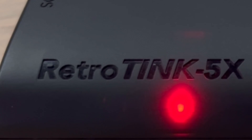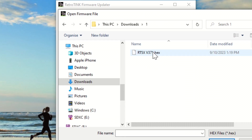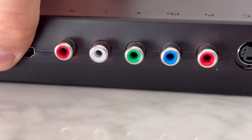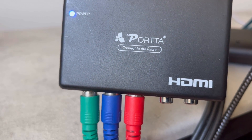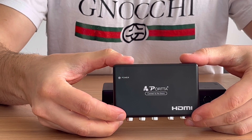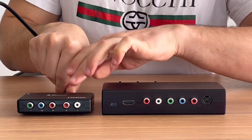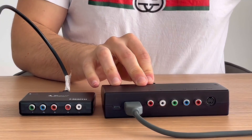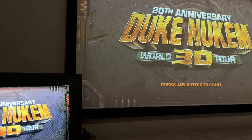The red LED light indicates it's ready, so open the update tool and the device should now show. Select the firmware and flash it to the 5X. The SCART port accepts as high as 31kHz with combined sync, but the component input will accept up to 720p. So to input HDMI for downscaling, I'm using a Lagless Porter HDMI to component converter, which purely converts digital to analog without scaling. The console's HDMI signal goes into the converter, then outputs component to the RetroTINK, with digital video going through an HDMI to VGA converter, and finally the HV sync is passively combined to output analog RGB/RGBS to the CRT.